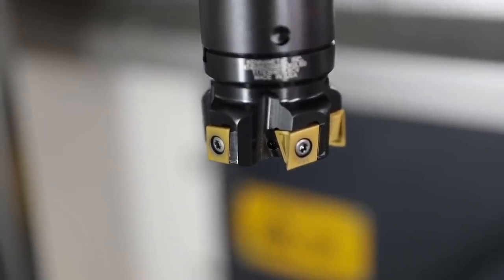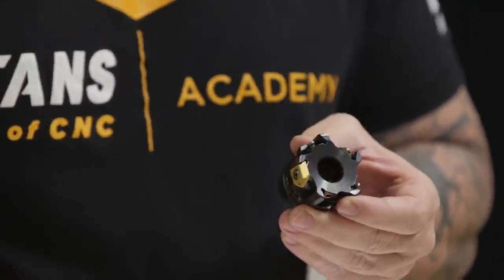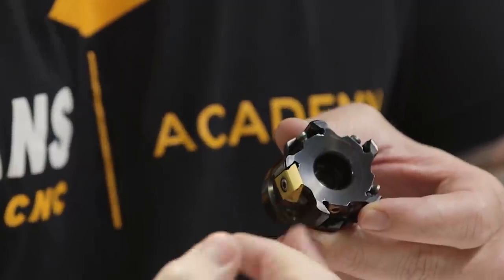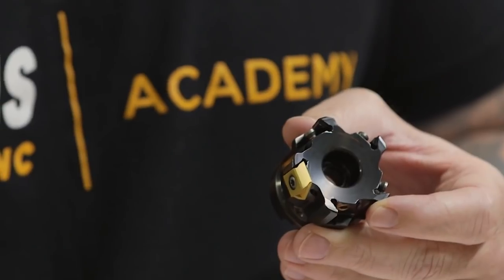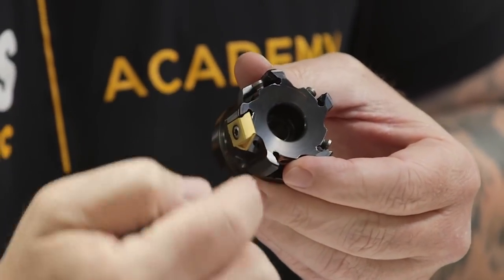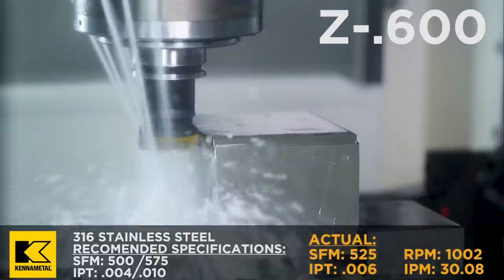One is, the screw is actually coming from the side straight in to the center. And because it's not flipped this way, it's actually flipped this way. And this is the cutting edge. Look at how much carbide is behind it. If it was this way, then the carbide is thin. But because it's shaped this way and all the force is coming into it, you have all of this carbide behind it, strengthening your insert.